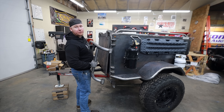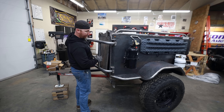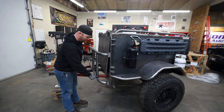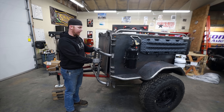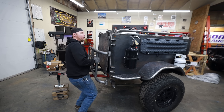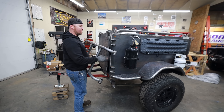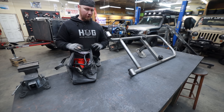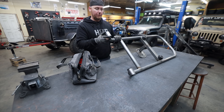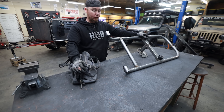We are clearly prepping everything for paint, and you want to check fitment — this is exactly why right here. This is off quite a bit, and it's from when I welded this last bar in. It clearly distorted the steel just a little bit, so we need to figure out a way to stretch that back out and make it true so it can fit back on there. I'm thinking we're going to take a bottle jack and try to stretch this out — I'll pull some measurements and we'll try to stretch it by about 3/16 of an inch first.